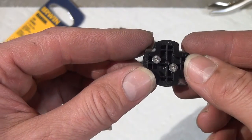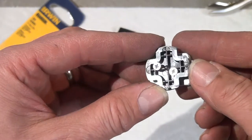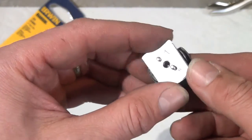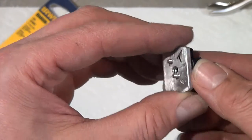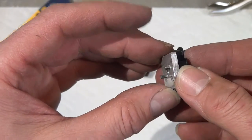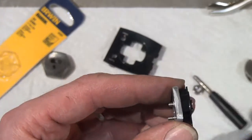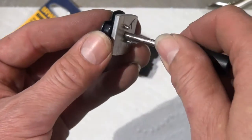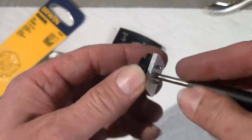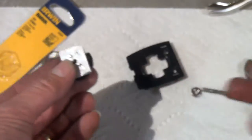It's important to have a gamepad which has an integrated D-pad instead of four different buttons, and this is why — because you couldn't attach the aluminum piece to four separate buttons. We've threaded the 3/32nd bolts through here and test-fitted it to make sure that it will work. Then we'll take it apart, assemble it through this piece, and you'll see the results.